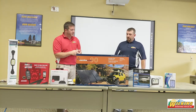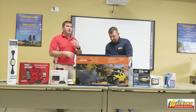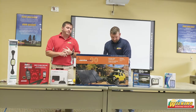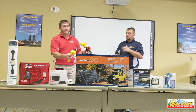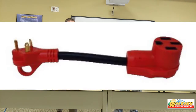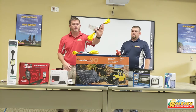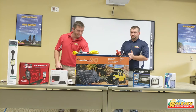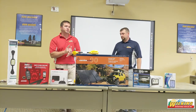We did speak about our 30-amp and 50-amp shore cord ends. Some campgrounds don't have both types of plugs, so if you can't get a campground site with the correct power outlet, you can purchase an adapter. These adapters let you plug your shore cord in to adapt up to a 50-amp service site or down to a 30-amp site. A 30-amp cord has three prongs, 50-amp has four prongs, and we're always feeding 110 electricity into our camper, never 220 or 240 volts.